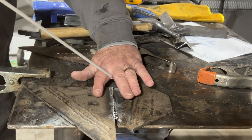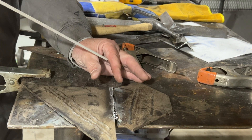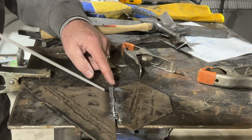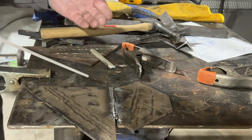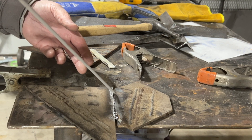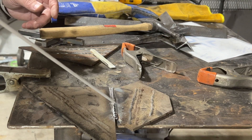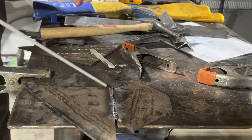What you're doing is as you come this way, you create a pool. If you envision this is the hot melted flux and steel — as I drag it, this pool will follow behind the stick, it just kind of follows this way. And as it gets farther from where you were, there's less heat, and so it solidifies. Depending on what your amps are on your welder, how slow you go, and what angle — how well your pool is — depends on how deep you penetrate. These are pretty thick steel plates, so you're going to have to go fairly slow. That's how you control how big of a bead you get and how deep it penetrates. That just comes with practice and experience.